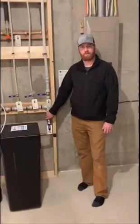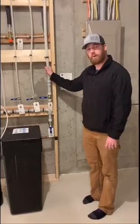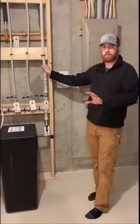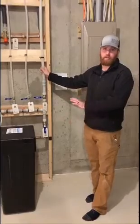Here we've got our water main that supplies water to the whole house, and a couple of shut-offs. This is your irrigation line. You want to make sure you contact your landscaper in the fall months prior to freezing to come out, turn this off, and blow out all those sprinkler lines. Then re-contact them in the spring to come back out and fire it all back up again.